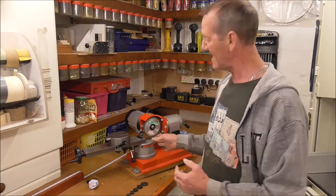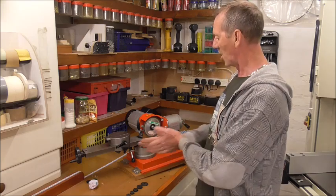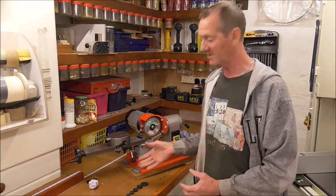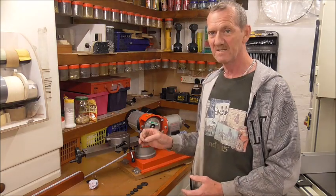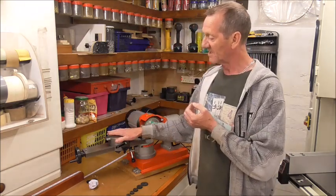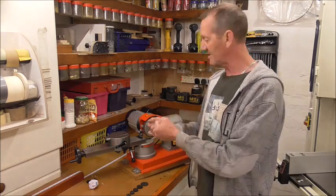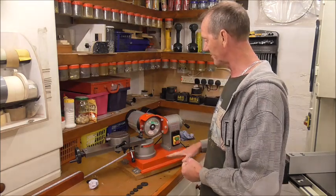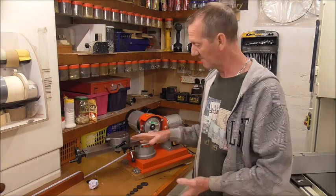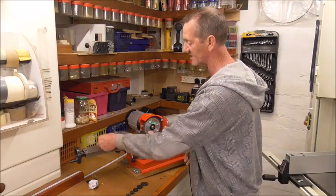To be fair, I haven't found anything downside of it that says they've made it cheaper. All I will say is there's a few things that, because of its value, it's not been as finely prepared and finely looked after. All the castings, I've gone over and polished them all up, and greased them all, and oiled them all. They're all a little bit gritty, a little bit sharp in places, coarse in places, stopping things moving sweetly like I would imagine a £600 machine would do. But now everything is beautifully smooth and works as it should.